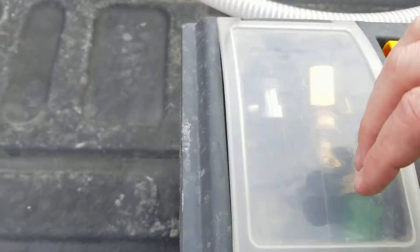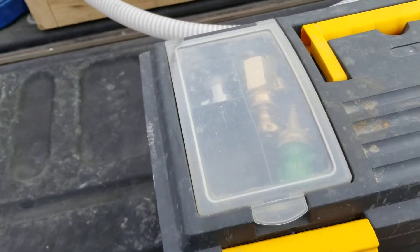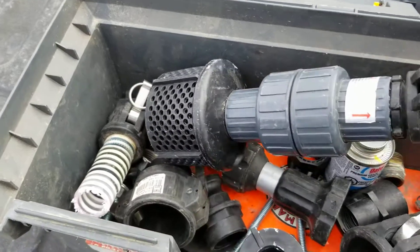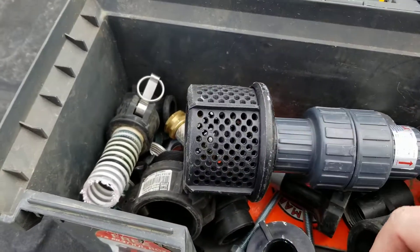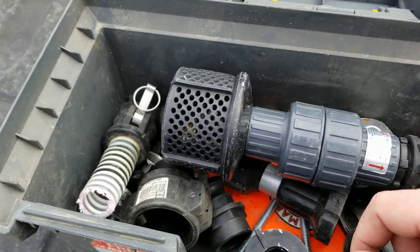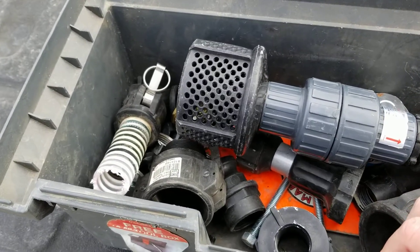Another piece of three-quarter-inch hose barbed there — that's all going to be part of the return line to the pump. There's a check valve on the strainer. I kind of made the strainer; it came with the pump but didn't have any cam locks or anything, so I rearranged things a little bit.